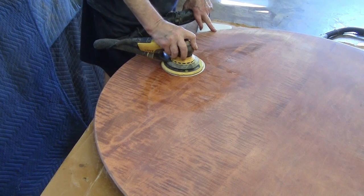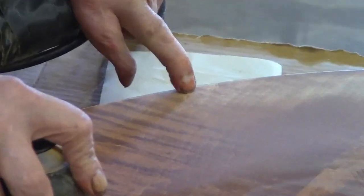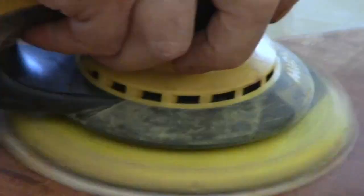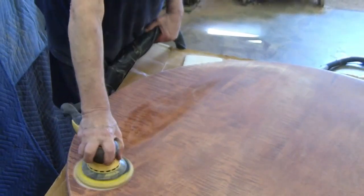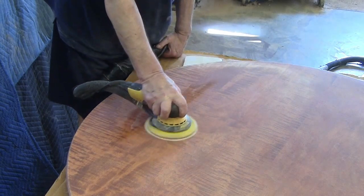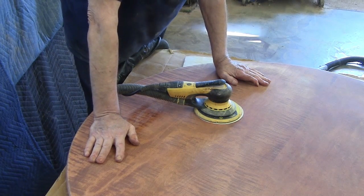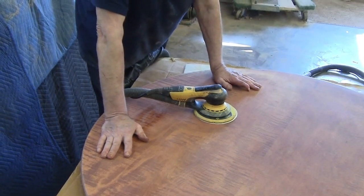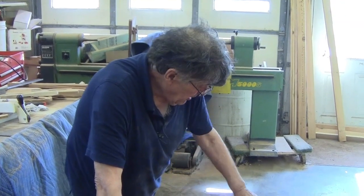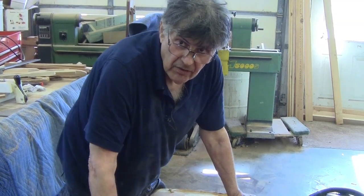As a matter of fact, I got a little bit right here. Can you see how light I got? Now, I am going to tell you this. An oil-based stain, as a glaze, works, but not near as well, because just like right here where I've gotten light, the oil itself is going to try to seal off, and it's not going to color in near as well.